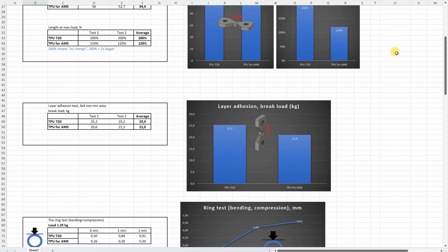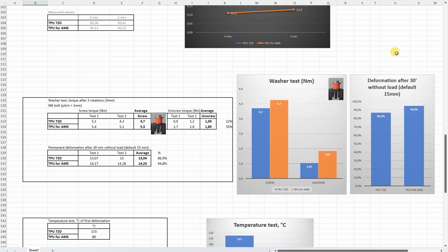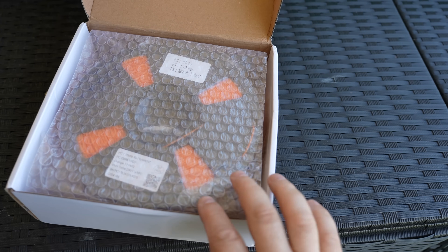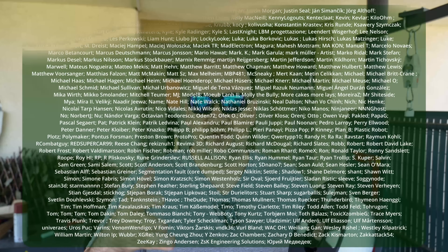As a summary, our results one more time without additional comments. This line will be added to the summary table for my Patreon supporters — I have a separate sheet for TPU and flexible filaments. For practical applications, use this filament where you need impact and wear-resistant material with some minimal flexibility. Printing with this filament is not so hard if you know the correct settings — first I tried TPU settings which resulted in too much part cooling and warping, then Nylon settings which caused melting in the cold zone. Good settings are somewhere between. I'm expecting similar challenges with my next CC3D filament, which is a mix of polycarbonate and PETG. Thanks to all my Patreon supporters and Polymaker sponsoring — happy printing!